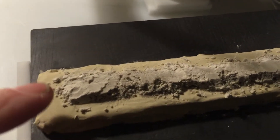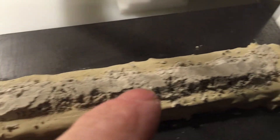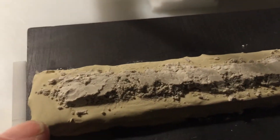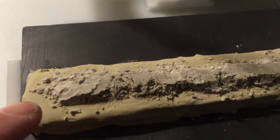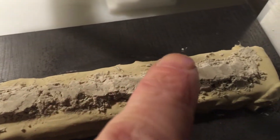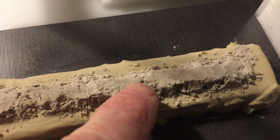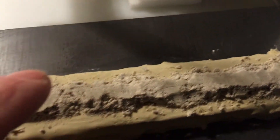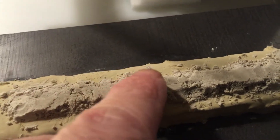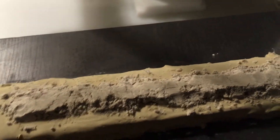What I've done is I've placed on the carbon electrode, and I'm going to be placing a layer of flour of pumice on top of this, on which it will sandwich one more layer of the same mix to create a very layered substrate that we will subject to the electric field. We'll determine if we can create more than just a glassy channel — to see if we can create some form of glassy cavern out of this pumice material that we were seemingly able to melt before.